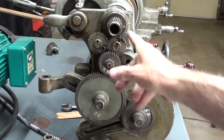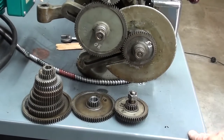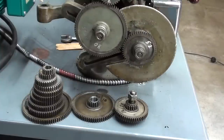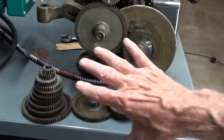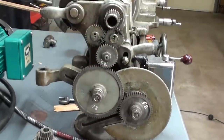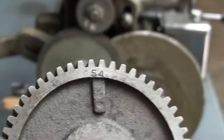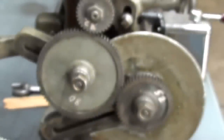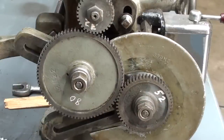In addition to the gears that are already installed on the gear train, you will have received, when you bought your lathe, hopefully a set of the change gears. There's a dozen or more, and some of these have cluster gears on them and shafts — try to get those if you don't already have them, because you certainly will need them. Each and every gear has the number of teeth stamped on it someplace — sometimes on the rim, sometimes on a solid gear. If you do not have them marked, mark them with a paint marker.